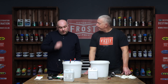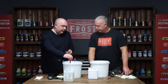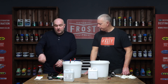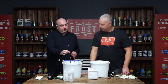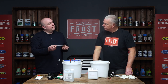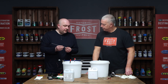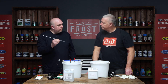Clip that onto the bar. The thing that's different between this and the plating kit is that the only metals that can go in here are aluminium and the lead. So we need to use one of these — these are aluminium rods. The method of attaching the rod to the part is really crucial, because the anodising process makes the aluminium non-electrically conductive during the process, which is obviously a problem if you're relying on it. So the contact between the aluminium rod and the part you're anodising has to be incredibly secure.